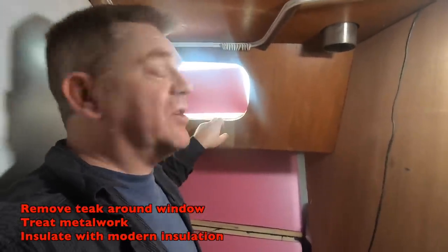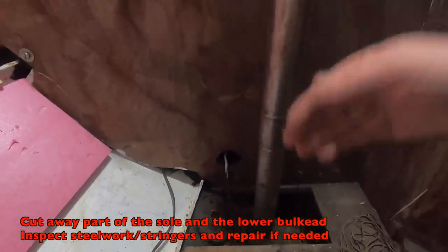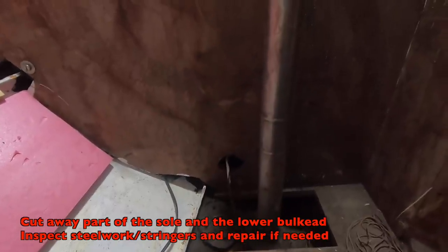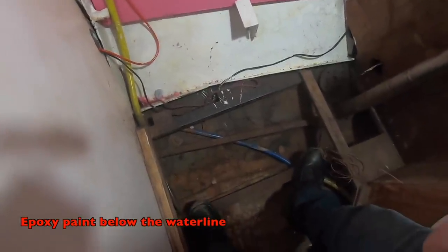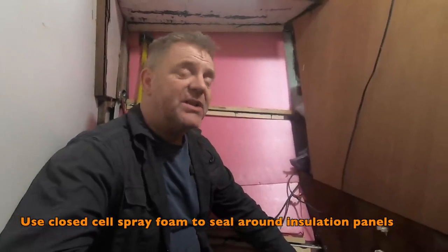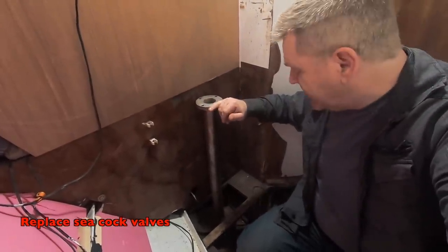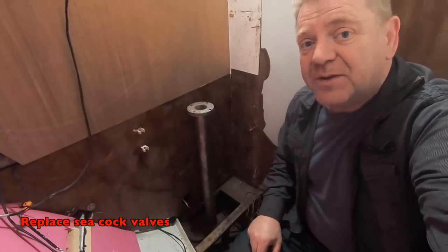In the head, we need to remove this panel of wood and treat the corrosion and rust around that window frame, cut out part of the floor and lower bulkhead to assess the steel underneath. Melissa has already painted above the waterline, but we need to paint below the waterline with epoxy as well. The pink closed-cell insulation will be held in place using closed-cell spray foam around the edges. The seacocks go on stainless steel plinths — we're either going to reinstate the existing bronze ones or switch to the more modern plastic seacocks.